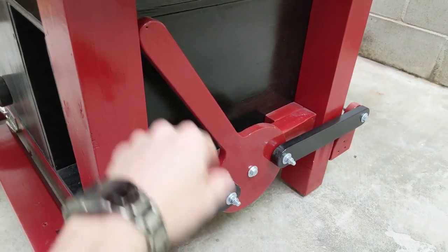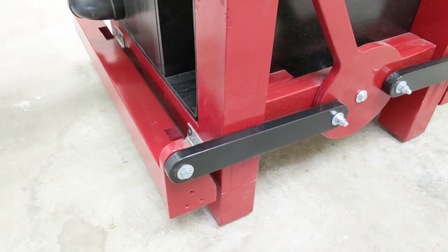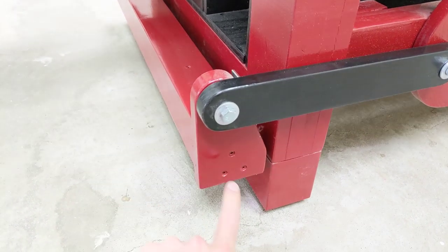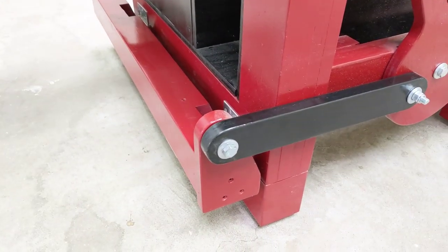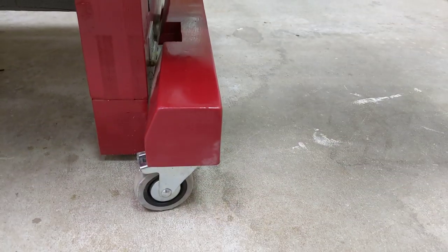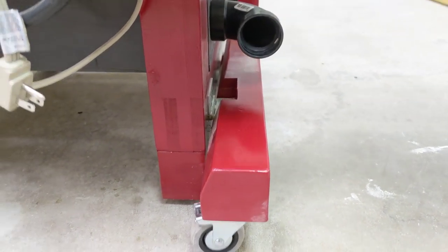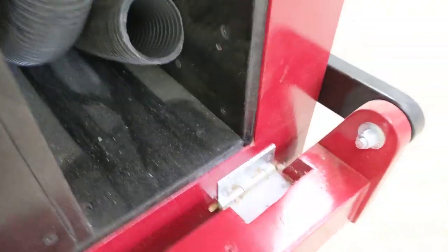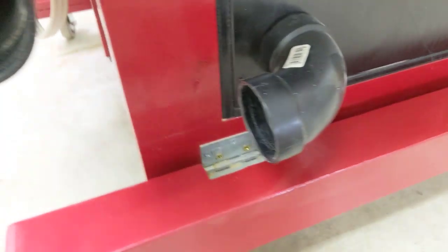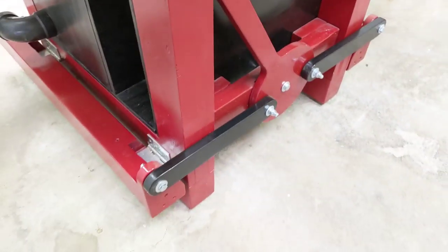Quick rundown on the construction. The handle is three-quarter inch plywood. The link arms are three-quarter inches thick, about two inches wide, made out of hardwood so they're nice and strong. These end gussets are also the same three-quarter inch hardwood, screwed and doweled into these legs so that they're nice and rigid. The legs are two two-by-fours glued together. The top one is beveled so that when the wheel rotates up it can go flush against the cabinet. The hinges are just regular door hinges, recessed down in because there wasn't any material to mount them on top. Casters are just screwed in from the bottom and all the nuts and bolts are half-inch hardware.